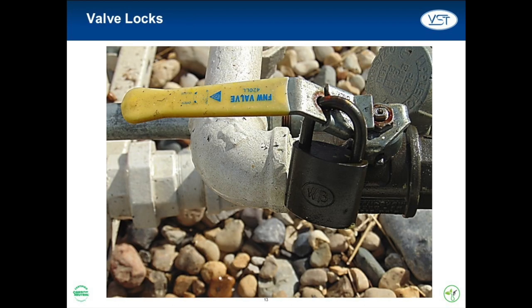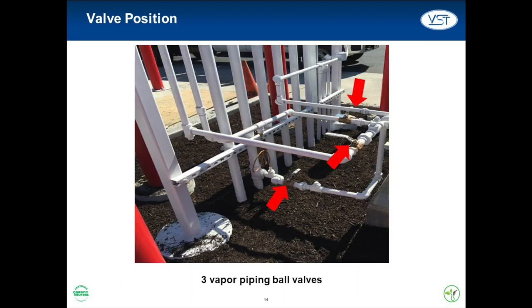The Green Machine comes with three lockable ball valves. These lockable ball valves prevent any non-authorized tampering with the Green Machine, and all valves must be locked after installation is complete. During installation, all three lockable ball valves on the vapor inlet, vapor outlet, and air return must be locked in the closed position. This is to prevent any vapors from escaping from the UST to atmosphere. After installation is complete, these three valves must be locked in the open position. Note that the closed position is perpendicular to the pipe.